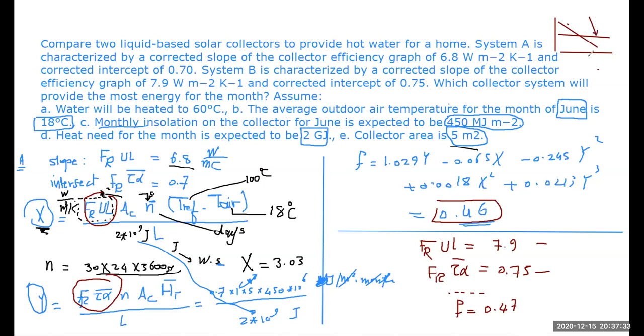So that's what I'm saying. If you need higher temperature differences, then basically you'll go for evacuated collectors. The flat plate collector can be very efficient if you are looking for heating up to 70 or 80 degrees centigrade. But going for 90, 100, 110, 120, then the evacuated tube collector is a better collector in terms of efficiency.